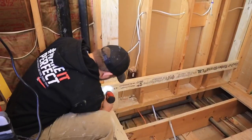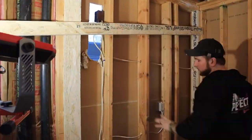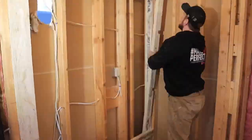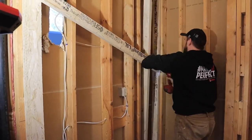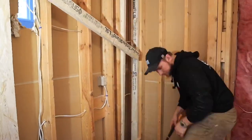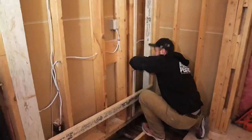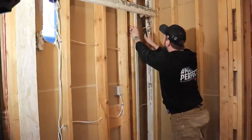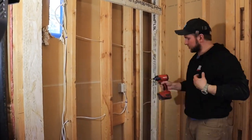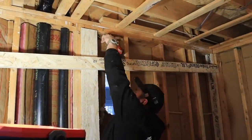Then I'm going to use one of these LSL studs as a guide, because it's so straight. If I use that, then all the other studs just have to touch it — like a little kiss, basically. If they kiss the guide stud, you know they're all in plane, because our right side is plumb and our left side is plumb. So if all the other studs are touching this guide stud, they're all going to be plumb as well. I'm just going to repeat the process, four screws into each one — that's more than enough.